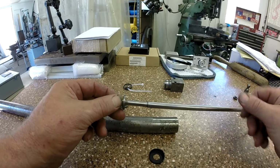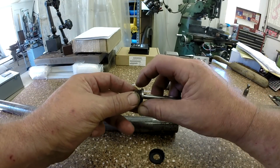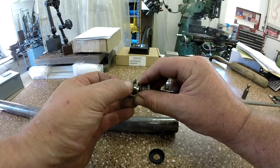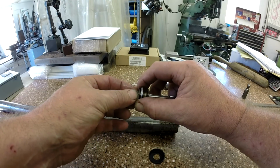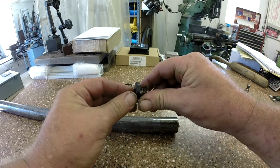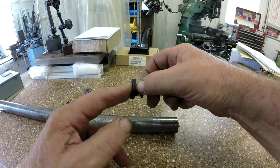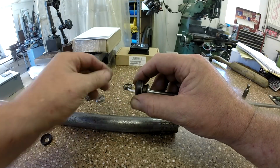Oh, I can show you. I can give you the idea of how it works. We've got a spring. Then there's kind of a spreader here that goes on. This all fits on the shaft. See, that's a kind of a spring-loaded spreader there. Then your cup goes on right on that, and that little bit of spring tension is what pushes out on that rubber cup.